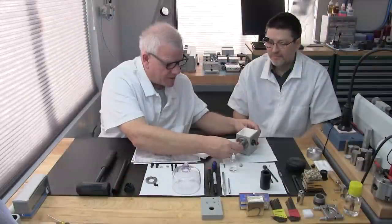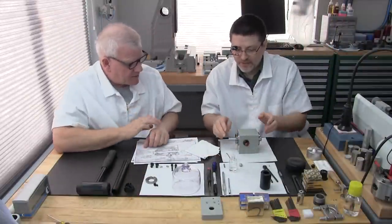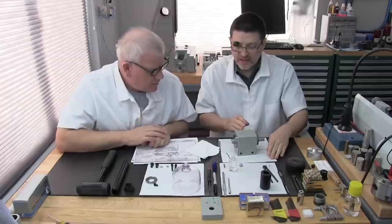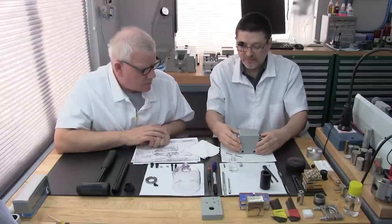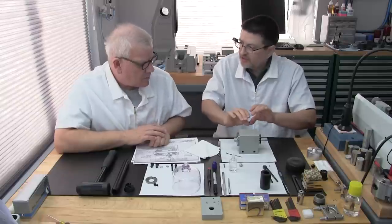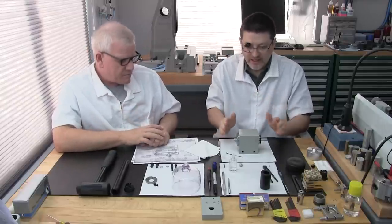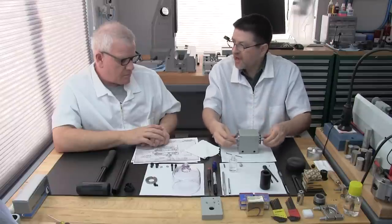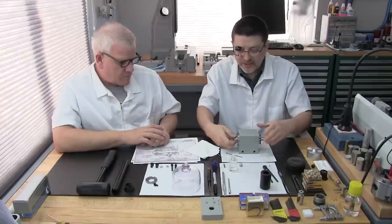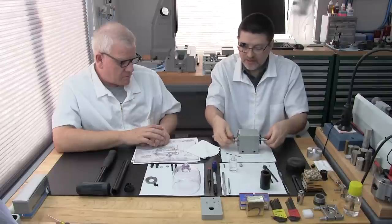Oh, yeah, pull this right in line. Everything's just beautiful. Yeah, isn't that nice? Wow, I can't wait to run that. Okay, when you're at this stage, this really is a big accomplishment, because the spindle shaft assembly is 100% done. And if you reach this stage and it spins smoothly, tight, there shouldn't be any axial play and no radial play.